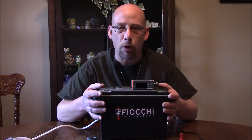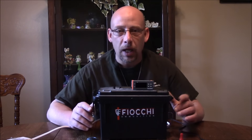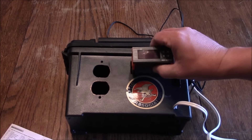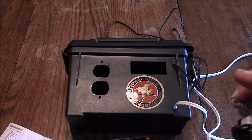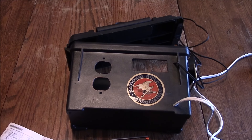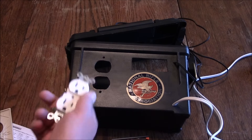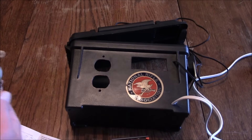You're going to need a couple of tools and a project box. I'm using this ammo can just because I think it's cool — it'll make people ask questions. First thing you want to do is figure out whatever project box you're going to use and cut out your holes so the unit will fit. I took a wall plate, laid it down, drew the holes out, cut them out with my Dremel, then switched to a sanding disc and sanded a little bit at a time until the unit fit. Then I laid the receptacle upside down, drilled holes through the mounting brackets, and I've got some little bolts with nuts to bolt onto the back side.